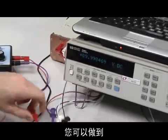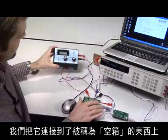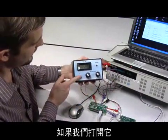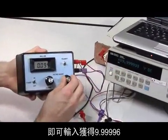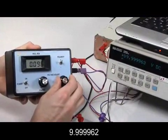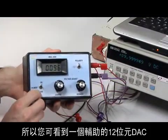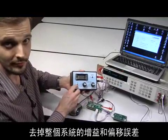So how do we trim out that error? We've brought the gain adjustment pin out to a little turret post, and connected it up to what we call a null box — just a voltage reference and a 10-turn potentiometer in a box. If we turn that on, we can dial in to get the exact full-scale value. So this is essentially exact. To do that, we had to apply a correction voltage of about 96 millivolts. You can see that an auxiliary 12-bit DAC is more than capable of trimming out the gain and offset errors of the whole system.